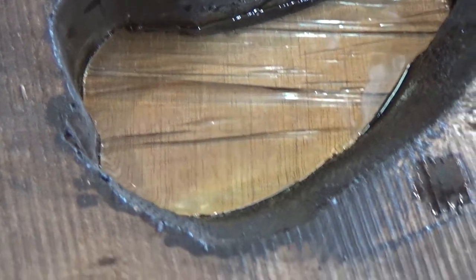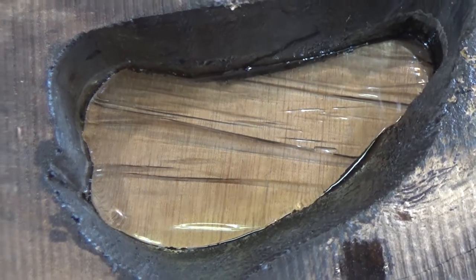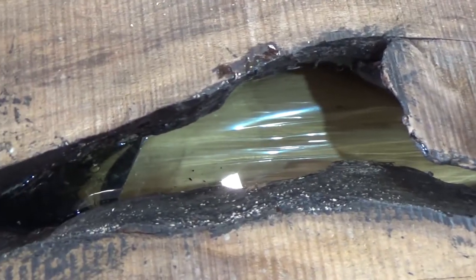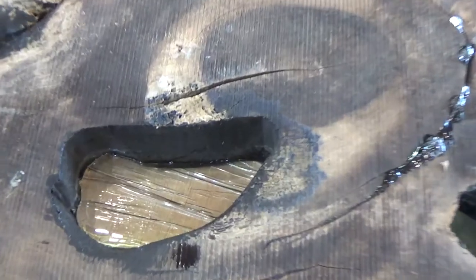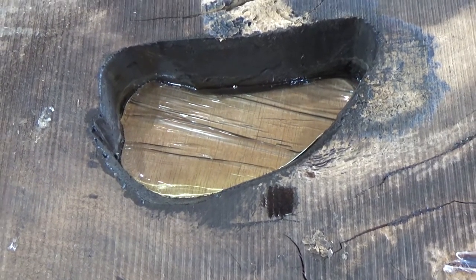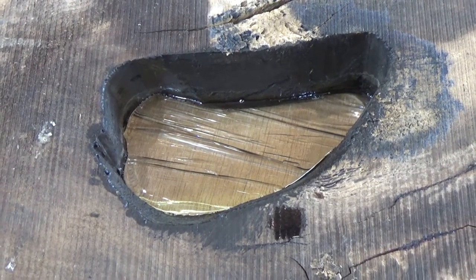Well, this is going much better. It's stopped generating bubbles so I can stop worrying about it now, I think. And it's still soft. So that problem of hardening unusually fast and getting really hot seems to have gone away — same with this one. I did stick my finger in it to see if it was still soft. So I'm pretty happy with that. I'll just wait now until it has fully hardened, flip it over, plane it back, sand it down, and I should have the top ready for final sanding.